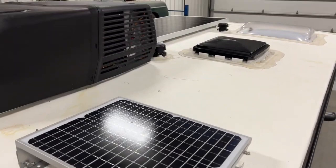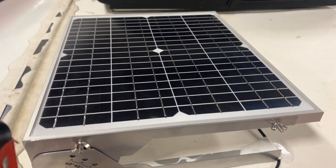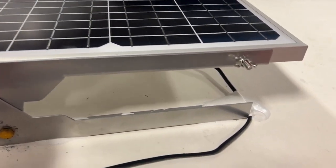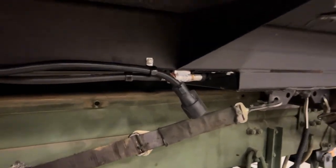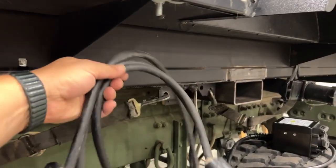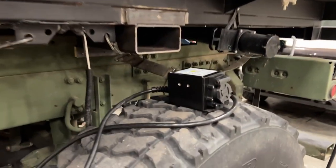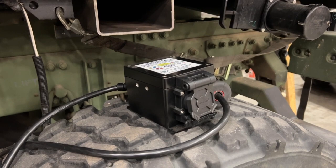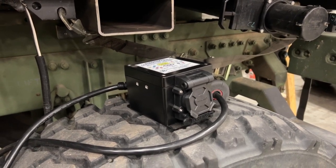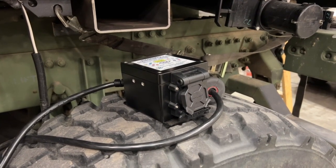I think right here, opposite of where I installed the other panel, I'm going to put my 24 volt panel. That panel is installed now and I'm using the sealant to hold all my wires so they won't vibrate and blow around in the wind. Now I've tied up the original trailer wiring back to this point — this is as far as it reaches. I'll need to take a trailer wiring extension cable to bring this further back so that I can plug into the box which converts the 24 volt signals from the trailer connector on the military truck to the 7 pin connector that the camper trailer uses. Let's connect them up right now and make sure this works before I tie everything up.